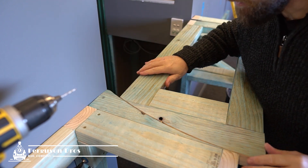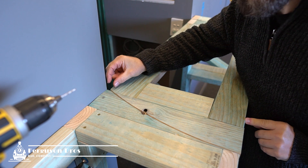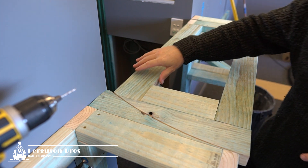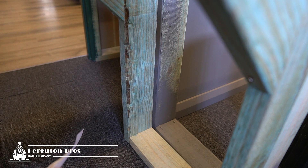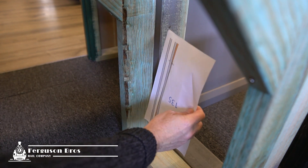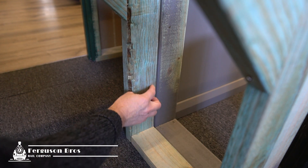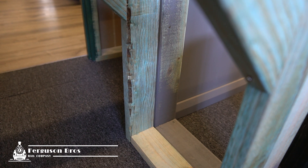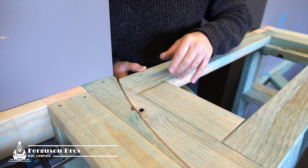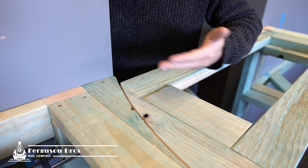The gate is coming close to closing all the way — nice and easy. But there's probably about 5mm that's got to go. If I use a bit of paper while closing the gate, up high I can pull the paper out, but down lower the paper's stuck. So I know somewhere in here I've got to take it down a little bit. I'll use a chisel and the sander. After sanding it's now closing nice and true with very little effort — I can actually use my pinky to pull it closed. There's a little bit of energy stored in the hinges, so when I release, the gate pops open just a little bit.